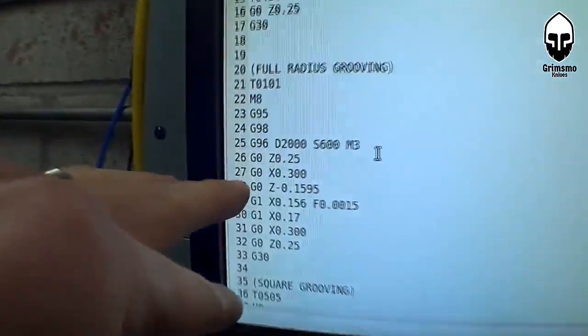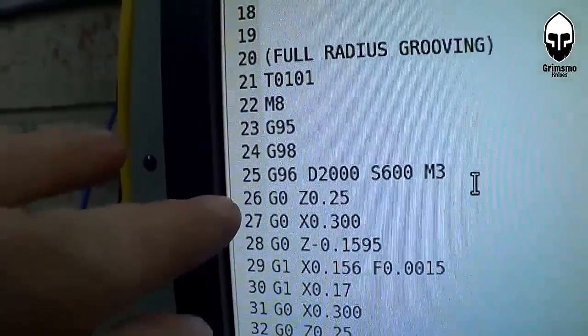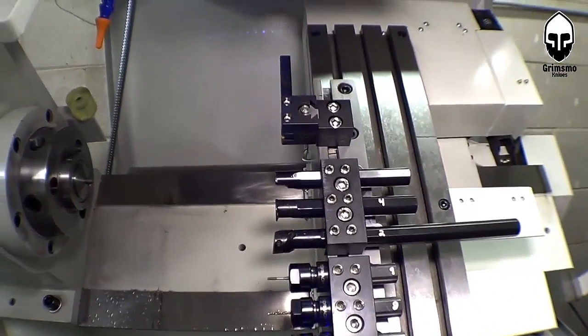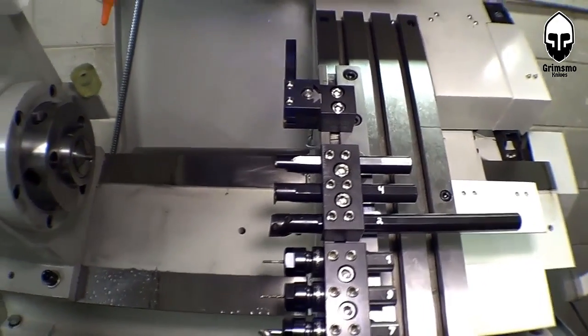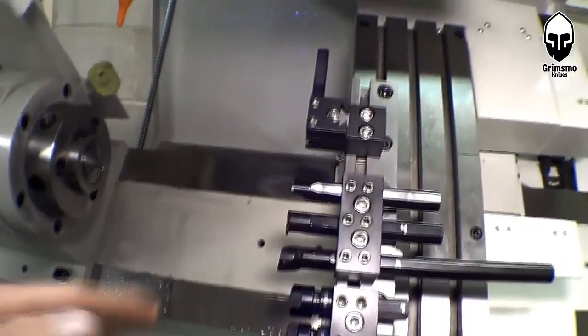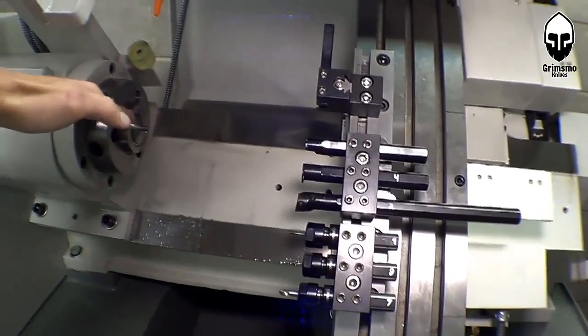It's stupid. To fix it, I think I need to switch line 26 to line 27 — to move X first, and then Z. Something like that should work. I should probably always do X first instead of Z first. With a gang style, you want the tool to go to centerline before you get close to it.